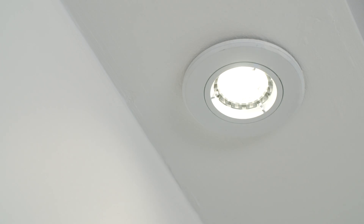We've introduced this feature because some LEDs simply won't switch on at a very low level. The Z-Bar LED enables you to set the lights at a slightly higher level for when you first start them. This ensures that the LEDs get enough power to come on evenly but then allows dimming down to the lower minimum level. This helps to achieve the very best dimming range for your install.